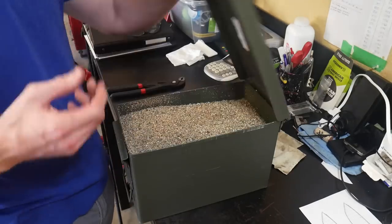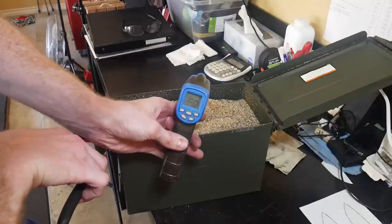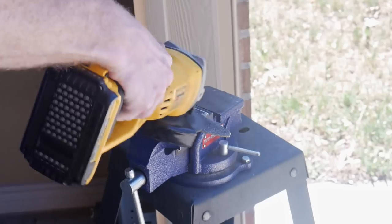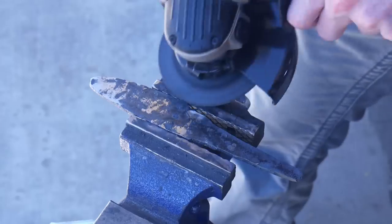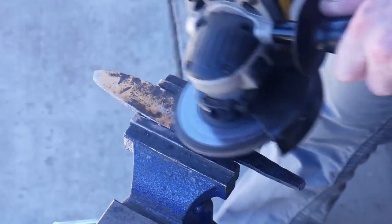By the time I take it out, it was around 290–300 degrees Fahrenheit. This ensures that the blade will be soft enough to drill and probably easier to grind as well. That thick forge scale you see on the knife is pretty rough on belts, so I took my angle grinder to it to knock the bulk of it off before sacrificing my expensive belts on it.